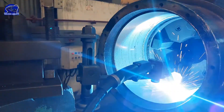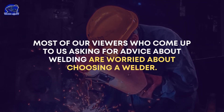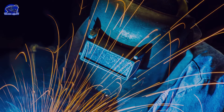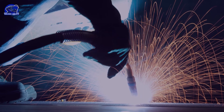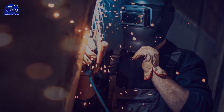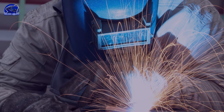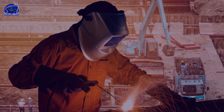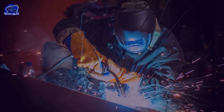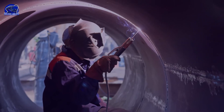Most viewers who come to us asking for advice about welding are worried about choosing a welder. It obviously depends on what you're going to be doing. For instance, if you're working outdoors most of the time on farm equipment, you'll want a stick welder for thicker metals and dirtier surfaces. You should use TIG welding if you're working on thin metals, HVAC, or doing frame work. You're probably going to want MIG welding if you'll be working indoors and want a wider range of capability.